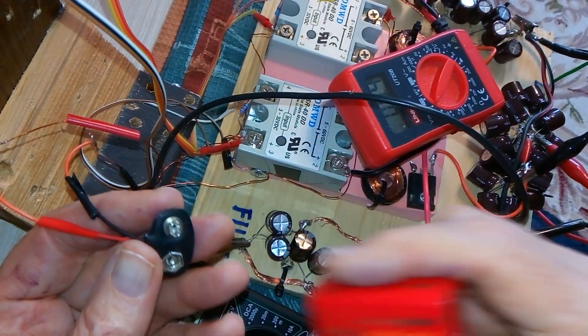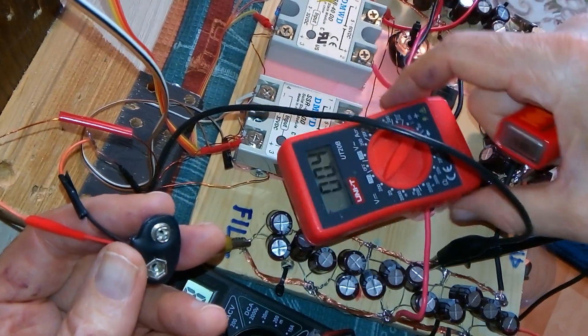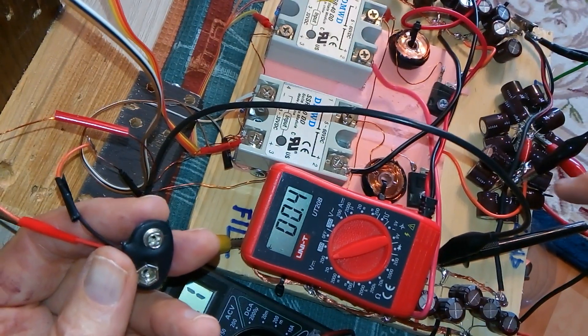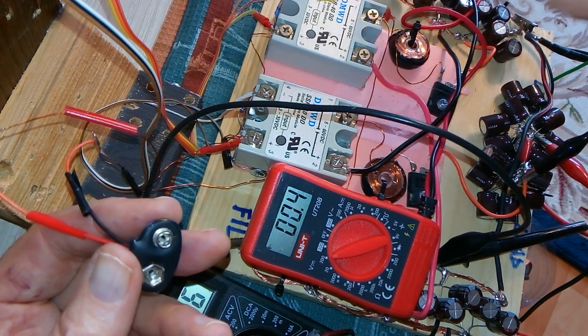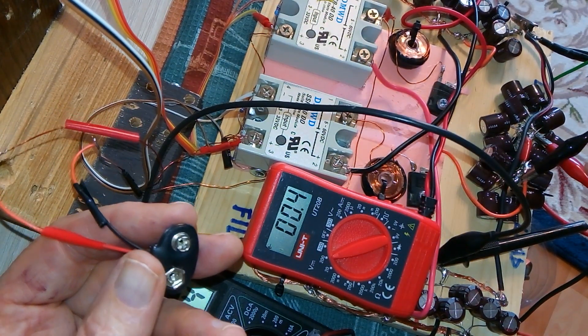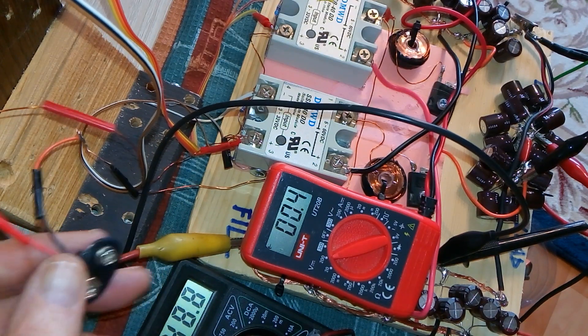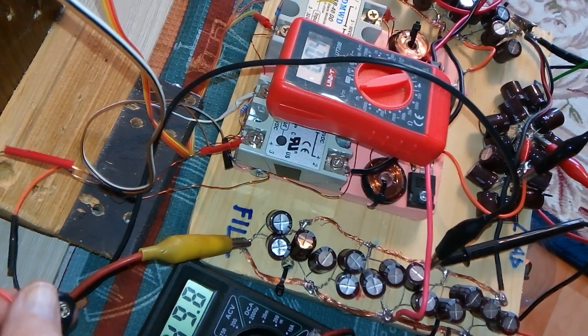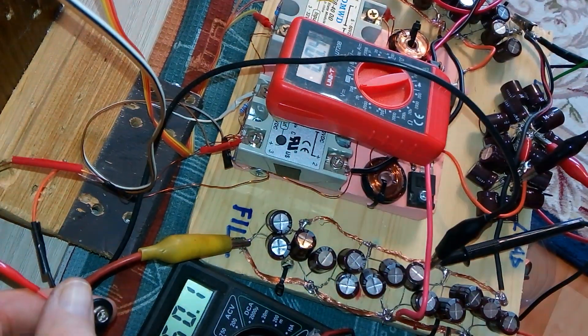So when I connect this, it's going to fill up. That's the fill cap, the end cap — I'm not even checking the in-between switching cap, just the fill cap. This is already up to 48 volts because I've been talking and just left the flyback going.